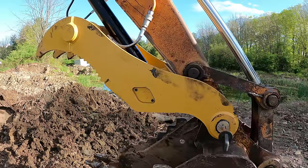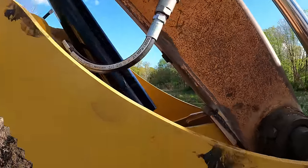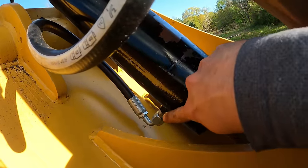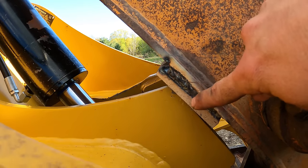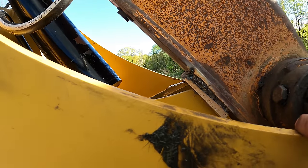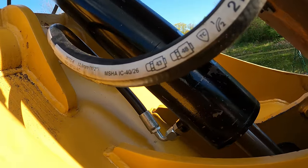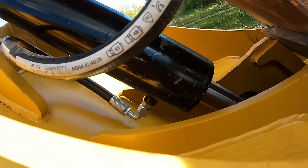One thing I was really concerned about was how much it tucked into the stick. So I had to weld this 3/4 plate here, and by doing that, it allowed me to not hit this fitting right here, because that fitting was hitting without putting this plate here. But you really kind of need a plate there anyways. You need like a wear plate, because otherwise you're just beating on a stick all the time. So they gave you a 1/4-inch plate, and it might have worked, but it would have been really close. You can see how close that fitting is to this thumb right here.